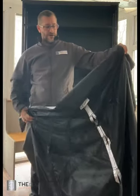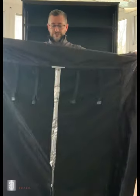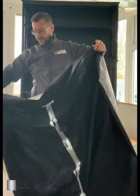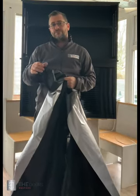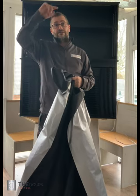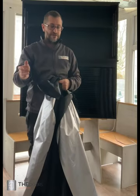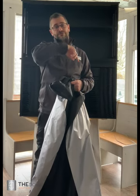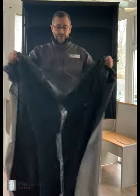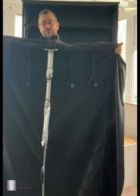And the thing to measure up is the opening. On our website, you'll see the dimensions of the screen, you'll see the total outside edge, and then you also see the opening. And the opening is key to make sure you know if it fits or not. So what you do is measure from rubber to rubber, top rubber to the floor. If you're doing a side measurement, the side opening, you check that width and you check the height from the top rubber to the floor, because you tuck the fabric into the rubber. Then what you want is that opening to fit inside your opening. If it goes over, then the screen is too big for you.